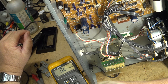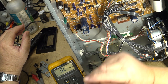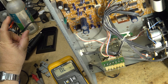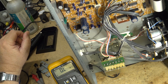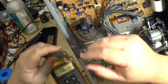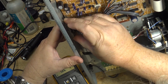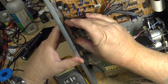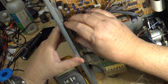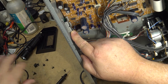And then I'll take that solder off that motor so that we don't have magic smoke. Although this didn't smoke, it just popped just like that. But that's what fuse resistors are designed to do. I should have a 0.22, I think. I should have one, or one close enough, to get this one running, and we'll put that heat sink back on these transistors, because I took it off so I could check the transistors out, but they're obviously fine, I think, they're okay. So we'll put the heat sink back on it here, however it goes on. As I can get in behind there and put the screws back in.